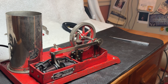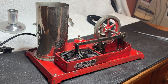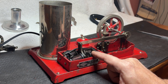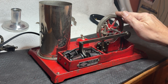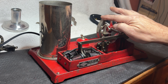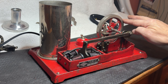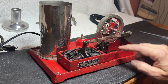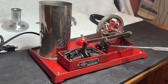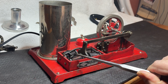I thought I would do a little video with the top of the coils removed. These are the solenoid coils. What happens here is when one side is energized, it pulls it, and then it gets pulled to the other side and goes back and forth. That's controlled by these contacts right here. When it's running, you'll see these things spark. Basically, this becomes a magnet, then this becomes a magnet, and it goes back and forth.